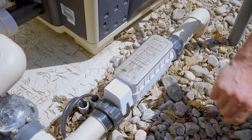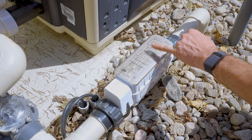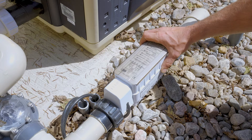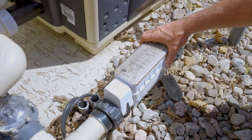Next is the status of our salt cell. If this light that says 'cell' is green, it means it's good. If this cold water light is on, generally that'll be in the spring when you first open the pool — the water's really cold. This salt cell doesn't work when it's too cold. All we have to do is turn the heater on, get it up to about 60–65 degrees, and it will start working. The light will go off.